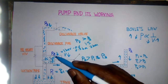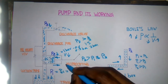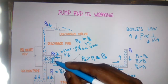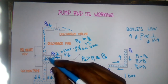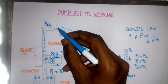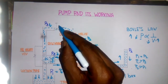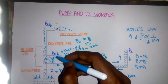In the next stroke, the piston is moving backward again and the pump is sucking water again, then pushing the water to the discharge side. The pump provides kinetic energy to the fluid, and this kinetic energy is converted into pressure, which helps to move the fluid or liquid from one place to another place.